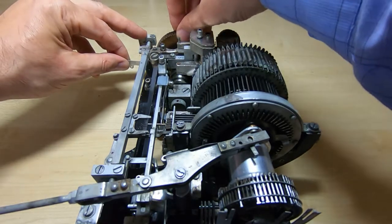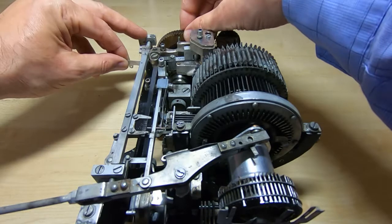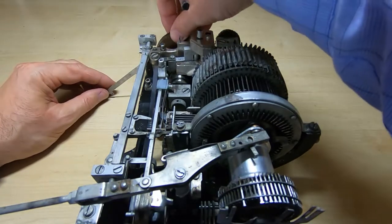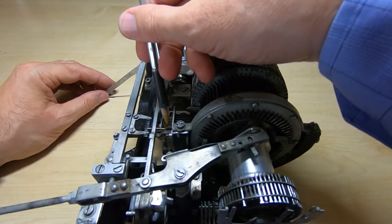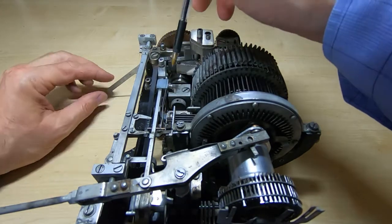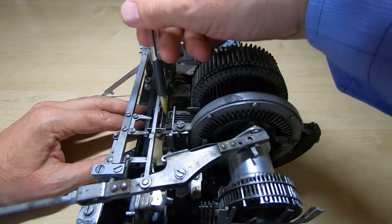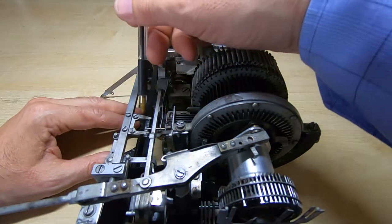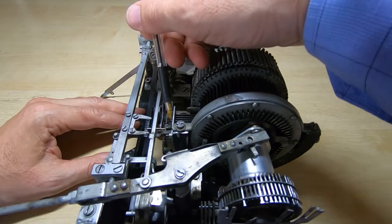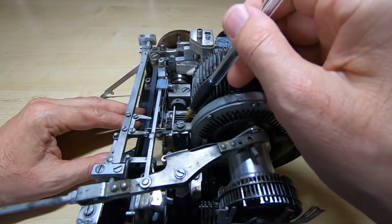The pin is pushed across and moves on to the next. We'll do another one and then finish with a zero — the solenoid is de-energized, and this time the lever misses the pin, leaving that pin in the zero position. So in this case we've selected 0-0-1-1-0. The next part of the cam cycle is going to raise these five pins. The pins left to the left are going to miss these levers, leaving them in the down or zero position, while the pins that have been pushed across are going to hit and raise them, putting them in the 1 position. So it puts these levers in the 0-0-1-1-0 positions.